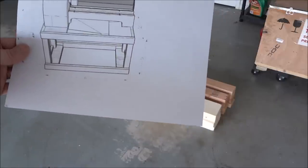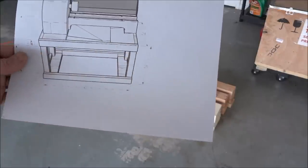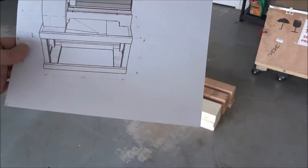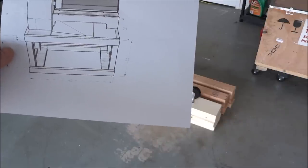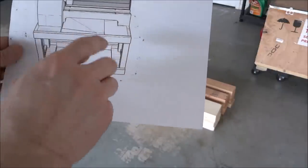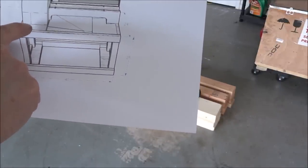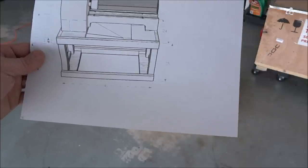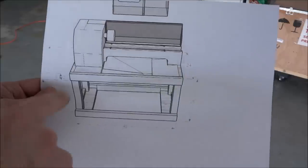This will vary — yours may vary. You can adjust this dimension however you see fit. It's going to be 25 inches wide or deep and should work out great. I'm going to put some 2x6s here and then underneath, and then I'm going to double layer some 3/4 inch plywood. That's the drawing and basically how I've got the legs worked out.